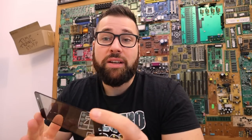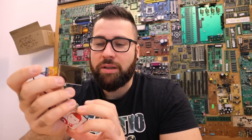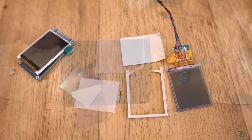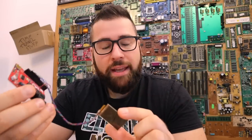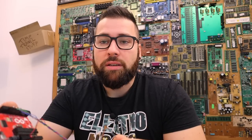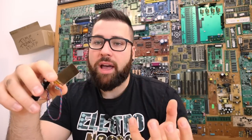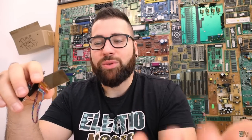For the 3D printer, the large phone screen is too big and difficult to control. So I bought this smaller LCD screen taken out from a small module — it costs only $3. To make it transparent you just remove the backlight layers from behind. You can control it with Arduino, read BMP image files from an SD card, and send them to the screen. I'll slice the 3D part into BMP images, display each layer, and use UV LEDs below to cure the resin layer by layer.